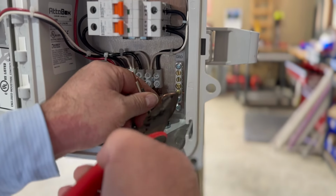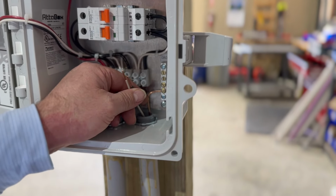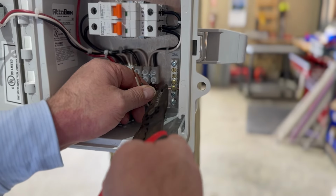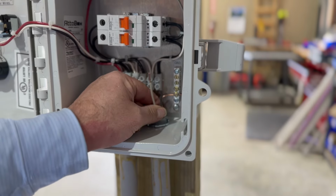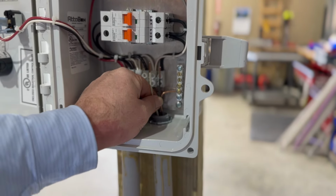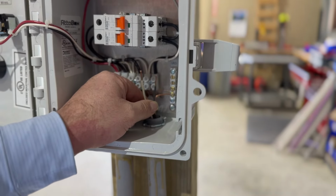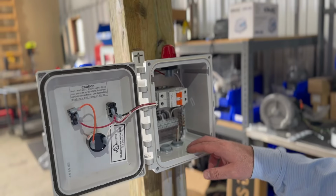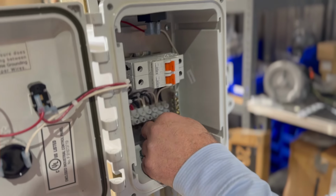You can use individual ones if you want, like, oh, the pump's going to go here. You're going to have a ground for this. There's no ground on the alarm floats. You know, so, oh, we're going to have a ground here and a ground there. You can use the individual ones. A lot of people just use the same one. They have a bunch of wires going in there. So we're going to have this, and we need a little screwdriver for this bus bar that we have on this panel. And you're going to look at this, and we're going to have to strip some wires back. But other than that, it's not going to be a difficult situation. Okay, so you have your power coming in. You have your white, your black, your ground. Okay, so your white goes in here.